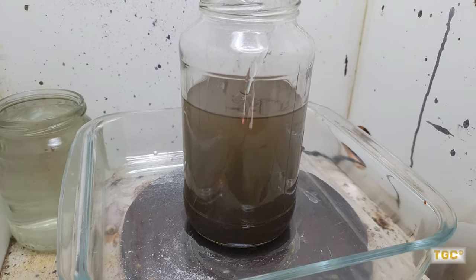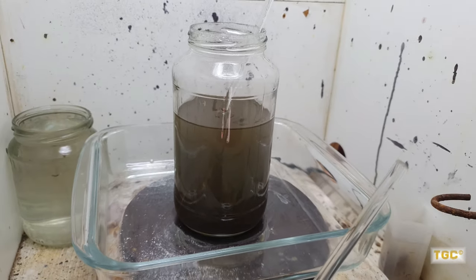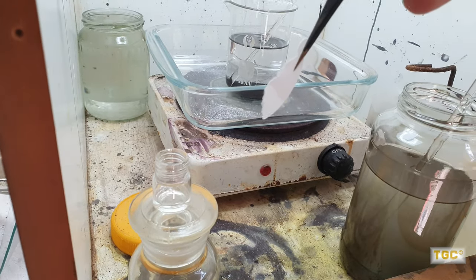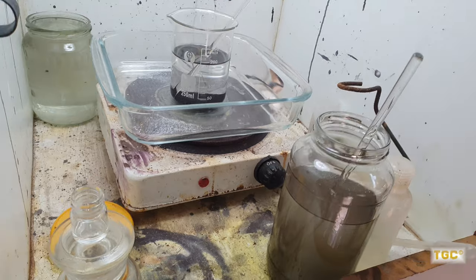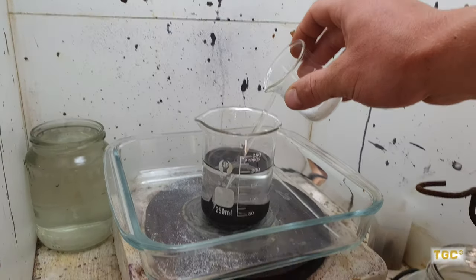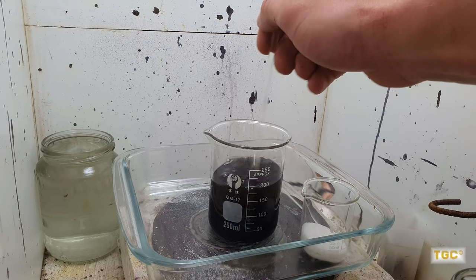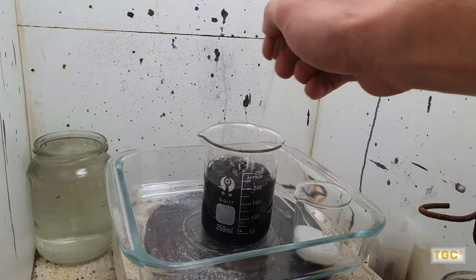I did, however, add a little bit more sodium metabisulfite to the gold solution because it wasn't quite settling as quick as I wanted it to — it might have needed just a touch more. So I'll do a stannous chloride test in a second and check it. Although I'm nearly certain that all the gold's out of the solution, we still always do a stannous chloride test. And that's a negative, so we're good — clean to start filtering. But before we do that, here's a little bit of glucose in a beaker. Let's slowly add it to our silver oxide and see what type of reaction we get. The reaction's actually meant to be quite violent once you add the sugar, so I'm going to take my time with adding it because I've never done it before.